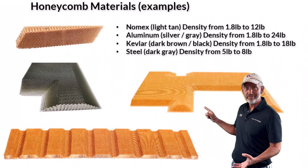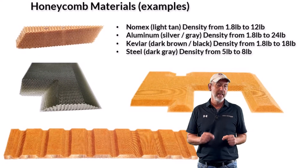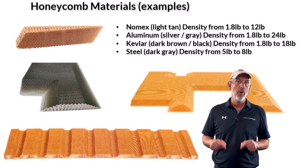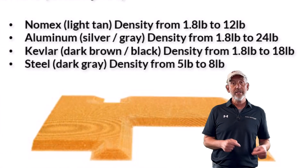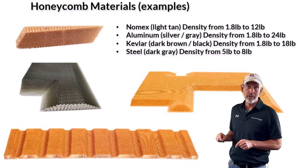Now the last one when we come to milling tools — and I'll also talk briefly about some drilling tools. We're trying to reduce delamination, fraying, and all that. Let's talk about one that intrigues me the most: honeycomb cutters. Honeycomb material looks like a bee's nest — it has those little thin walls and is used for lightweight but high strength. These thin walls take a little know-how to cut. It also comes in a variety of materials — mainly composite, but also aluminum and steel.